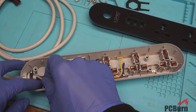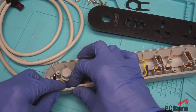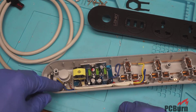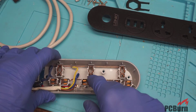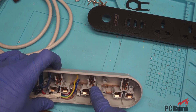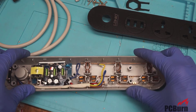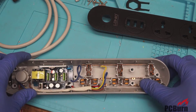There are immediately some problems inside. When I popped the top off, the power switch was actually hitting the cables — you can see some possible discoloration on the blue wire. That cable should be staked down, maybe with an automotive coupler screw with a loop to hold it away from the switch. Also, the ground has failed on one outlet — it's visibly much farther in than the others, and this is from relatively little use over about 12 months.